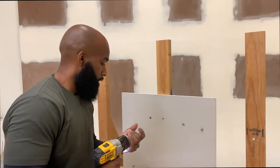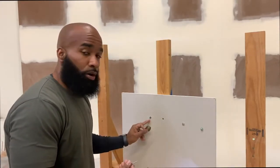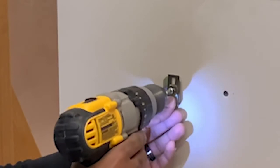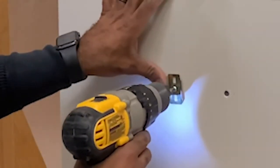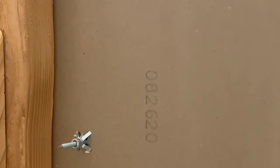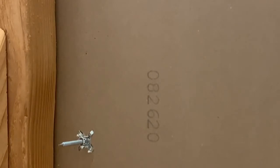This also uses a Phillips head screw. Now it's time to mount whatever you're going to mount — put your screw in and mount it to the wall. Now let me show you the unique thing about this anchor: you can see how it's expanding behind the sheetrock.